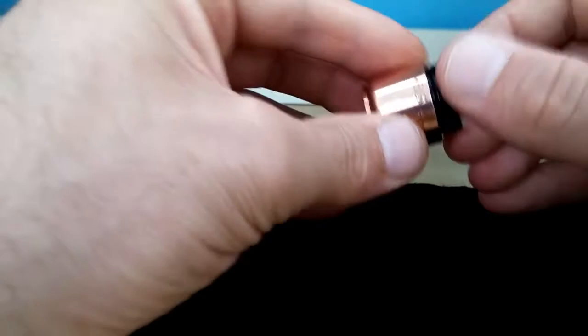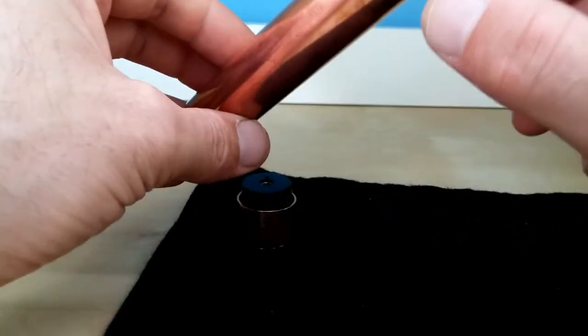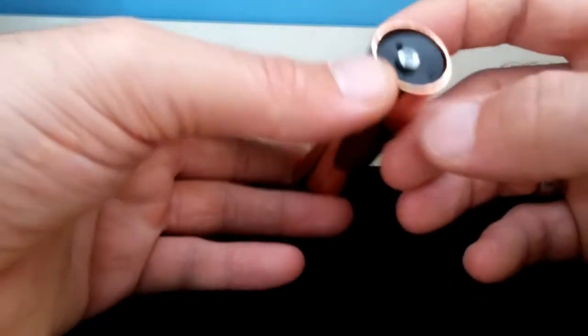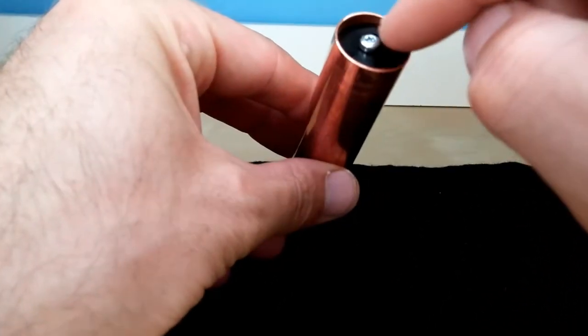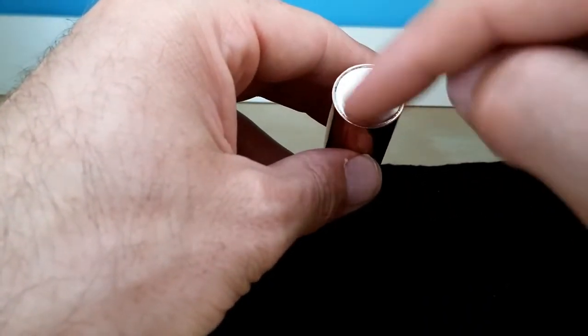Within the mod there's a piece of plastic with a screw going through it - that's your positive contact - and the top cap is like a hybrid cap. The only two things I would possibly change about this mod: I'd get a copper bolt and copper hex nut for the switch, and instead of having this piece of plastic with a screw through it, do it like the 510 with an insulator stuck behind it so that you're direct with your battery.